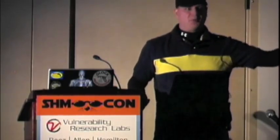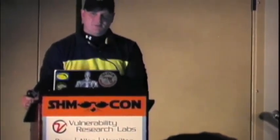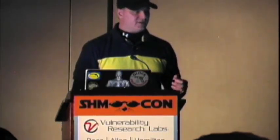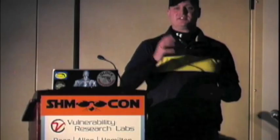It's called stiction. We used to have this problem back in the early days with RLLs, MFMs, and similar drives that would actually stick — and the fix was a screwdriver, or you take it out and spin it on the table in the opposite direction. But in newer cases they're actually really stuck. The exception is some newer Seagate and Western Digital hard drives in mini towers standing on end — if you jiggle the table, the platters are so heavy that in many cases the spindle will break free, but then the spindle inside will not turn anymore at all. So if you open up the drive and you're not able to turn it at all and the platters don't spin, your motor is seized — that's a more advanced replacement. But if it does turn at all and you can break the head free, you'll probably be able to read your data.